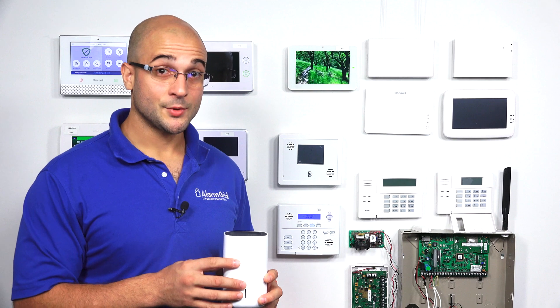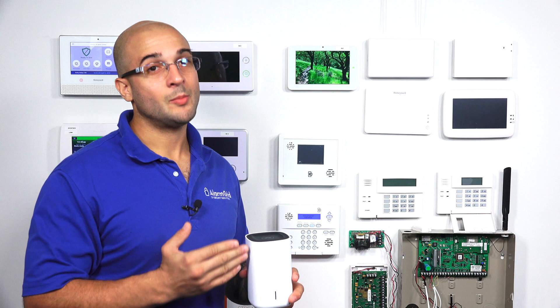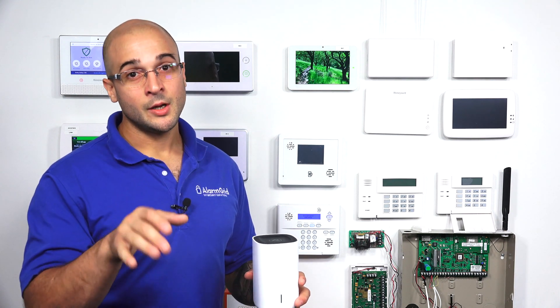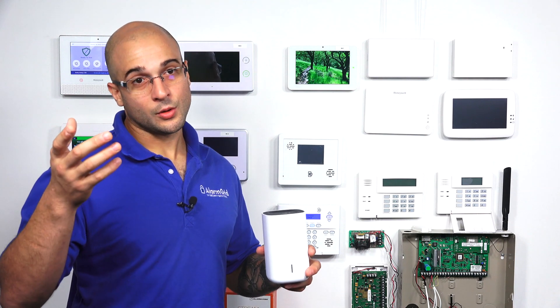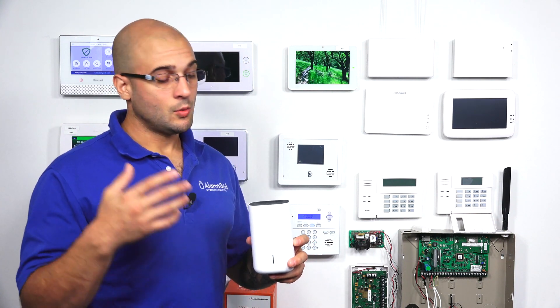This is going to help prevent that from happening, as this will allow the cameras to record directly to the SVR122, and then this is going to send it up to Alarm.com right from itself. The benefit to having one of these installed in the home is that if the internet goes down, as long as your router and switches and local network stuff is up and working, and the cameras have a Wi-Fi or ethernet pathway back to the SVR122, they're going to be able to record video and save it right on this. When the internet comes back up, this will be able to send all that video up to Alarm.com, and you'll be able to see it on a device.